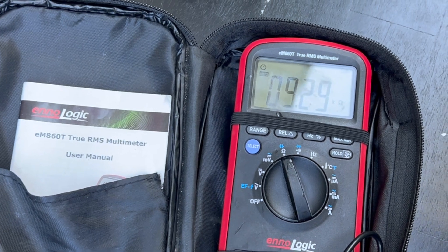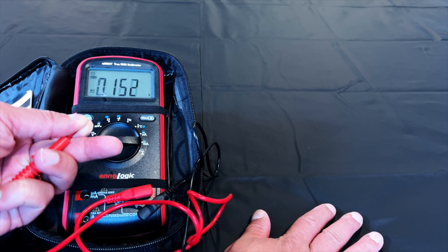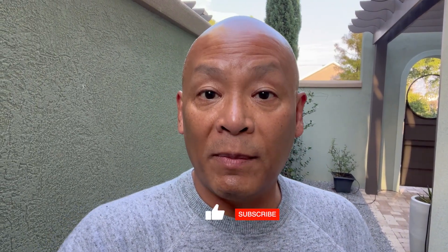I get good earthing and grounding here — my body voltage drops when I use earthing devices. That's basically how you check if your outlets are properly grounded in your home. Keep in mind I picked an outlet right next to the main electrical box outside; however, you could test any outlet in the home, but you'd have to run a wire from the grounding rod all the way to whatever outlet you're testing. You can also check the quality of your ground by how much your body voltage drops with your grounding device — you should see a drop of about 90 to 95 percent. So if your body voltage is one volt, you should see it drop below 100 millivolts. Thank you for tuning in. If you like this video, please subscribe for future earthing and grounding videos. Until next time, have a great day.